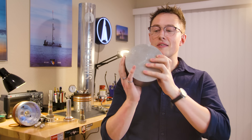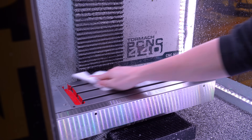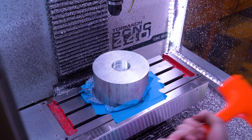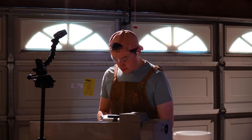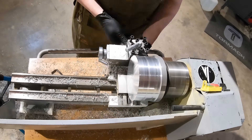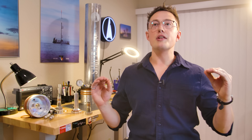We're starting off the build with this massive chunk of 6061 aluminum stock material, and our first operation is to drill a little hole in the center. I mounted the stock material using blue tape on either side and CA glue in between the part and the bed. I see you typing that comment about how you think blue tape is not an effective workholding strategy. What I want you to know, from the bottom of my heart, is that I can do it — I'm built different. We cut this pocket so we can mount it on the lathe chuck, which isn't large enough to grip around the outside. Then on the lathe, we slowly walk down the length of the stock to turn the outside diameter down — not just to get the correct part size, but because the lathe carriage literally cannot fit under the part. I need a new lathe.